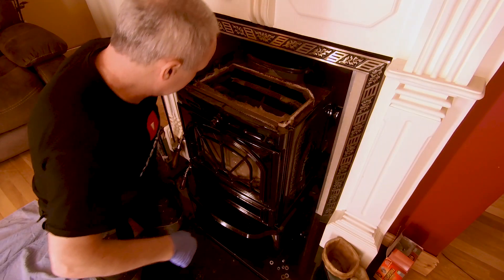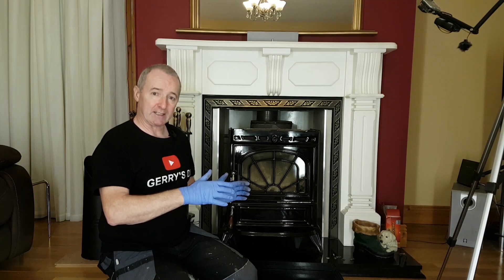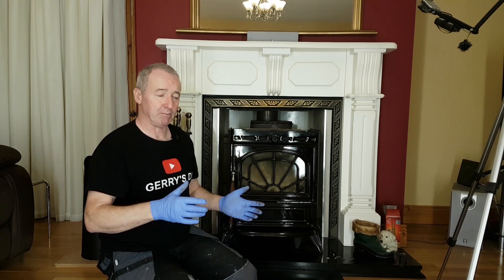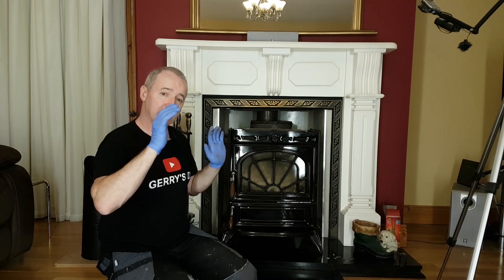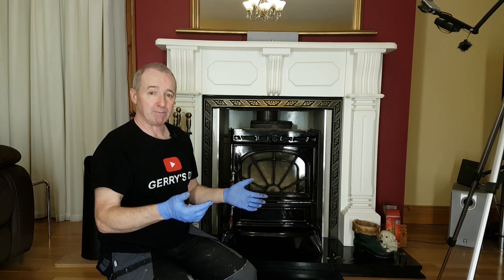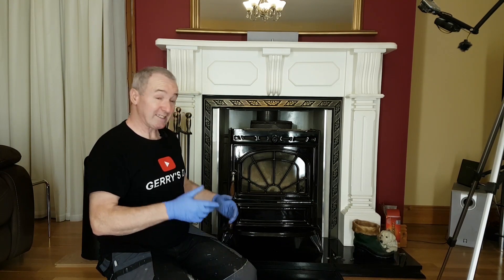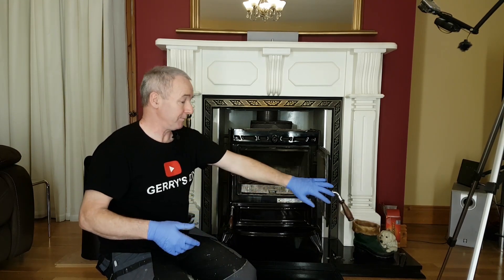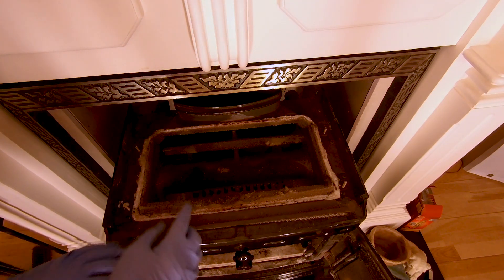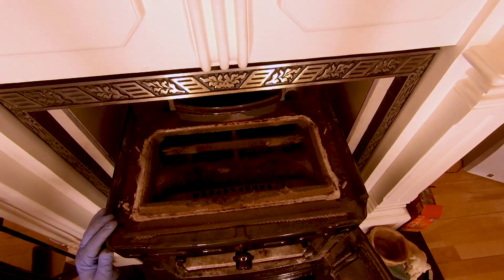It's actually a lot cleaner up here than I thought. I haven't cleaned the stove out for a couple of years, but when I run this stove I run it hot. It's sized maybe one or two sizes too small for this house - I've got 15kW to the water and I could really do with maybe 30kW. What I do generally is heat a slab, a floor area at a time, and work it around the house - sometimes two zones depending on the size of the room and how big a fire I've got. Most likely the chimney is the problem. You can see the fiberglass rope around here - that keeps it on. I changed these nuts and bolts from cast iron, retreaded the top with a metric thread, put bolts on it and used stainless steel nuts.